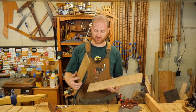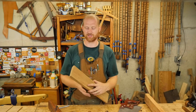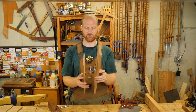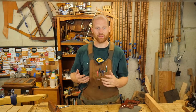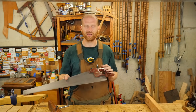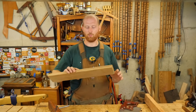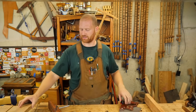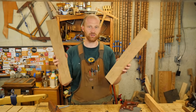To give you an idea of what I'm actually cutting — this is white oak, about 7/8 by 4 inches. I cut it down into about a quarter inch and a little more than a half inch. I'm going to be turning these into a chisel rack for an upcoming video. The first method, just using the rip saw, takes a little longer — it probably took me about 8 to 10 minutes to cut this one board, which is 1 foot 7 inches long. That's kind of slow, but it leaves you with a fairly nice surface. A few strokes with the planer and it looks pretty nice.